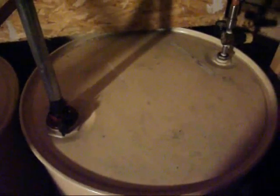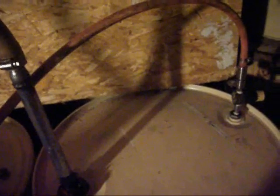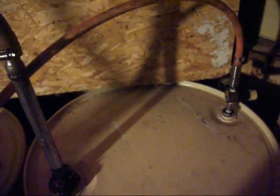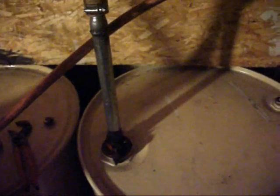I've got a couple barrels that are heaped, the tops are just rounded right off where I put 20-30 pounds in them, and they don't like it. So we're regulating it at about 10 pounds, and we just let the compressor kick on and off. And then when the compressor runs wide open for an extended period of time, we know the dip tube has stopped drawing.